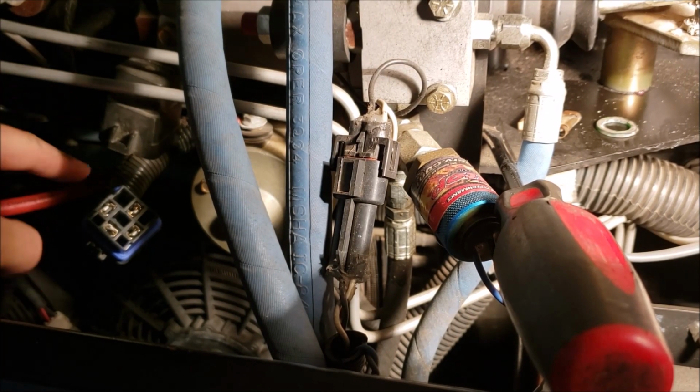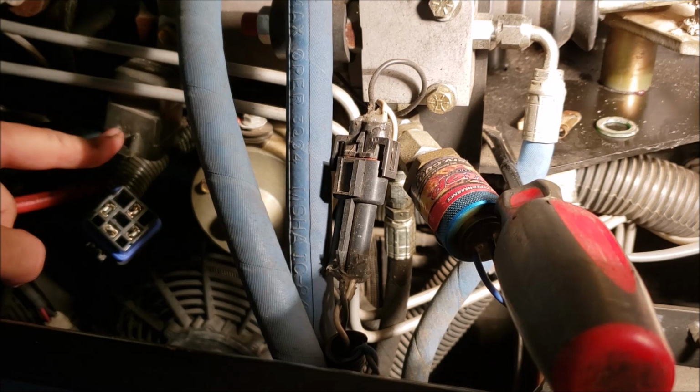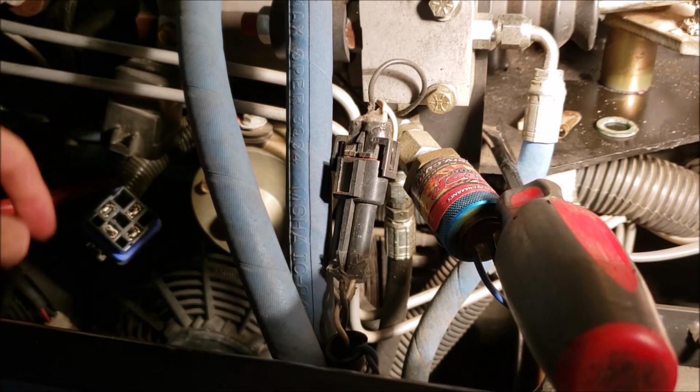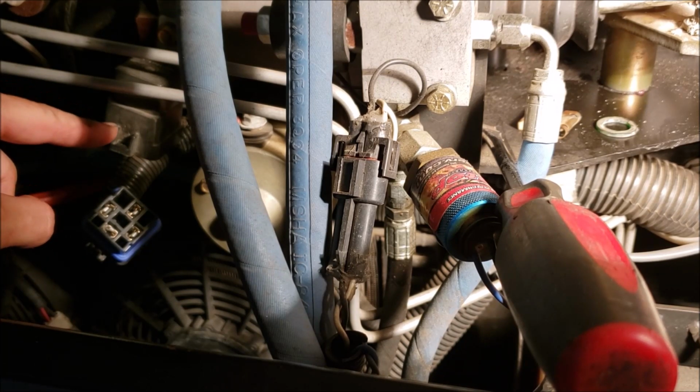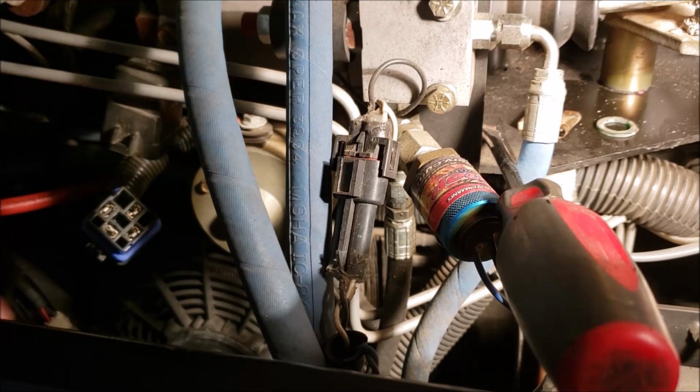As a side note, this crazy thing, a couple months ago, I went in the RV, went to start it. I pushed on the brake, because normally you'll notice in these W24s, you hit the brake pedal before you start it. You'll hear this motor kick on, make that noise. And I released the brake and it just kept running. This relay had stuck. Luckily I knew where it was at, so I quickly came out here and unplugged it. So just something to keep in mind.